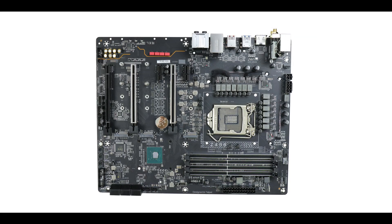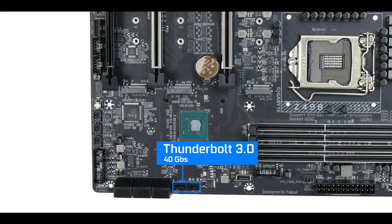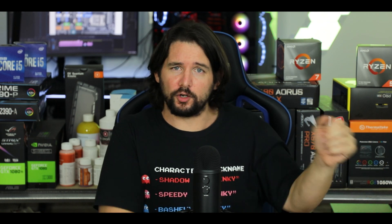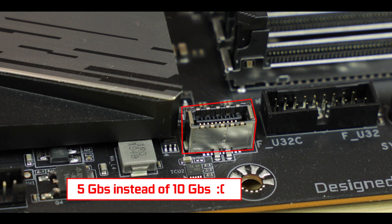Moving to board IOs: we start with the usual two second-generation USB front panel connectors for transfer and monitoring, one third-generation 5-gigabit front panel connector, a Thunderbolt 3 connector — a must on any Intel-powered motherboard — and a single-channel Type-C front panel connector. That's a bit of a bummer, because I've seen ASRock putting a Type-C that communicates 10-gigabit capability but then only providing a single channel. With a Z490 chipset we have plenty of bandwidth, so it sounds a little lazy from the manufacturer, and I really hope Aorus fixes this right now.